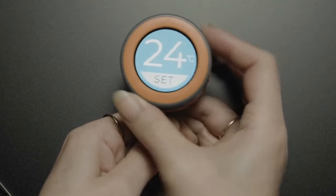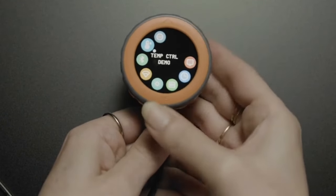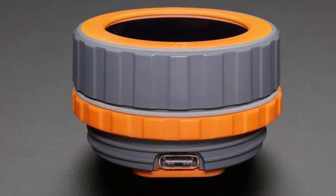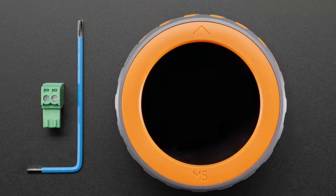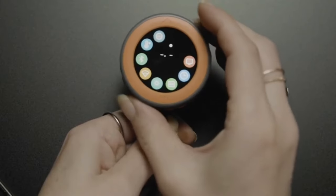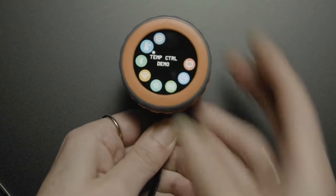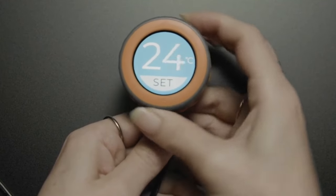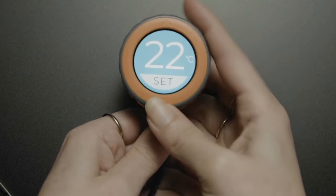This is an ESP32-S3 based touchscreen rotary encoder all-in-one module for a great price. A lot of people wanted to build or use something like this. Traditionally, something like this would be a couple hundred bucks, but it's now like $35, which is a really good price. And like I said, ESP32-S3, it's got the USB port. It's got an I2C port or two, Grove analog, maybe input, I2C input ports. You can use a Grove to STEMMA QT adapter cable and add sensors.